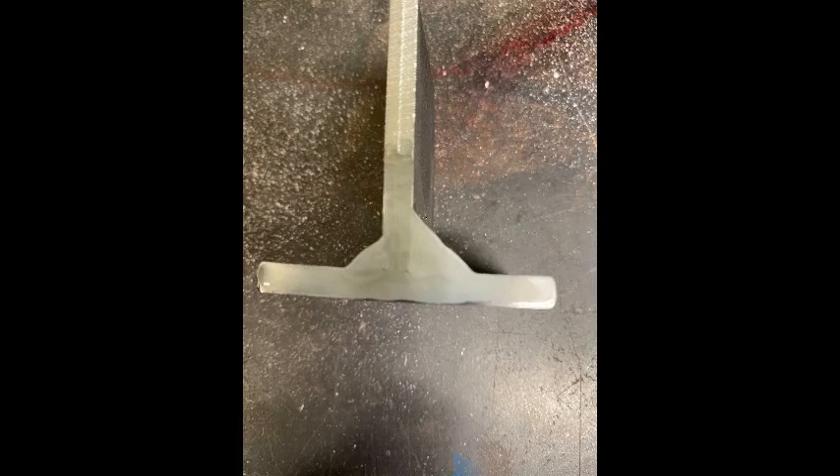As you can see from this picture, it highlights the area where the weld has penetrated into the parent metal, showing your amount of fusion into both plates. As you can see from this sample, the penetration on one side of the plate is greater than the other. The limitation with this test is that it only checks the area where you've cut — if you have lack of fusion or any inclusions, it will not find them down the whole length of the weld. Plus, it is a destructive test, so once you've cut the part it obviously becomes unusable.